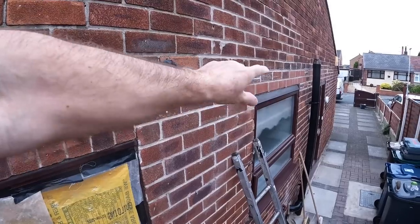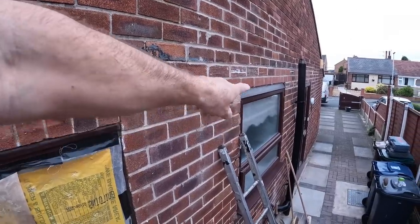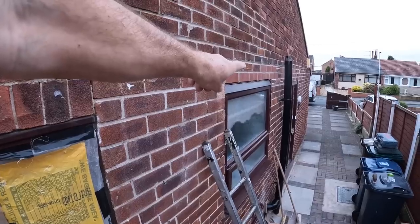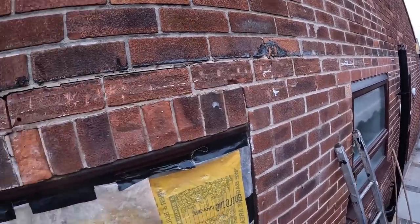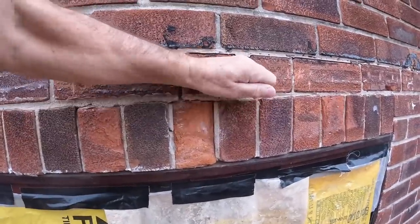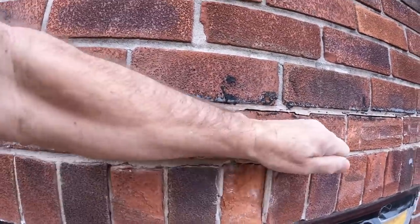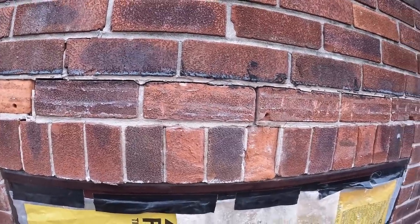That horrible trim there on the angle like that, it doesn't look right, but that's the only way you can do it without covering the lintel and the weep vents. It's got to go under the lintel, so at least these two will match. So no power tools needed. I'm going to whip this out now and get these acros up and under and get this lintel put in. Catch you in a bit.